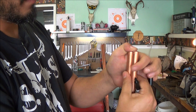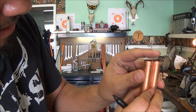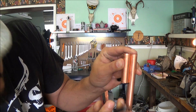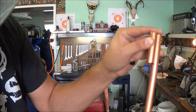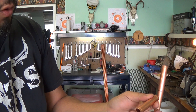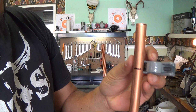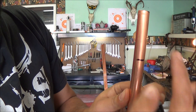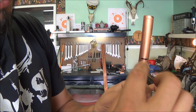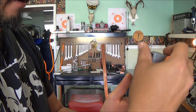This is my preferred method when building a lot of things — rather than measuring individual pieces, I'll get one cut and then line it up here and mark it on the pipe. When you mark it on the pipe, you're going to be marking on the side that you don't want to cut. So when you line up your blade, you'll want the blade to be on the top side, leaving your mark below it — that way those pieces will be the exact same size.